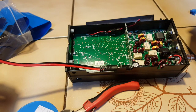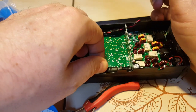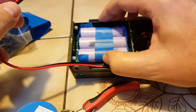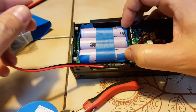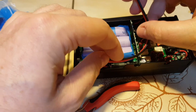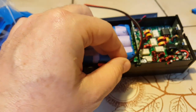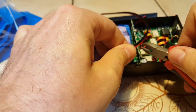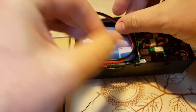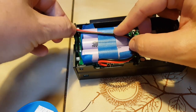I want to make sure the wires are properly routed and the connector is connected here to the plug on the KX2 circuit board. I'm placing my 18650 cells — I put tape on them to avoid any shorts — and I'm going to see where the wires are going to go. The plus will go right here. I can take my pair of pliers and just mark it — that's long enough.